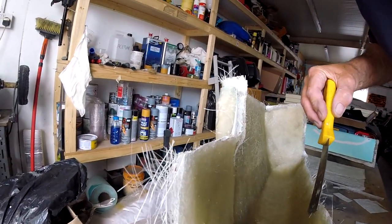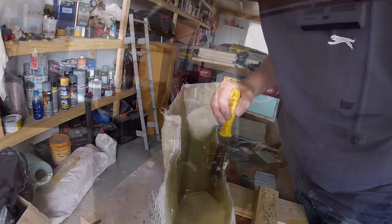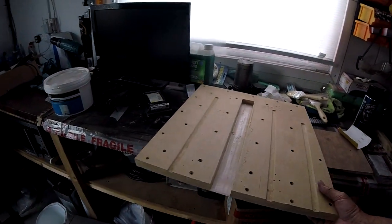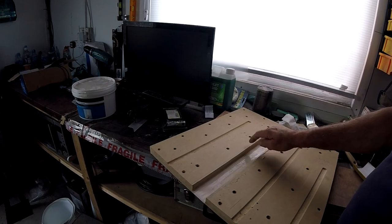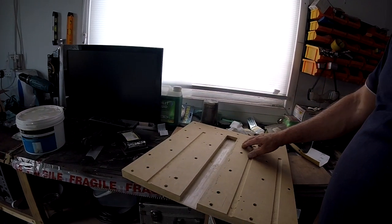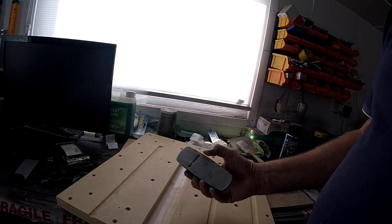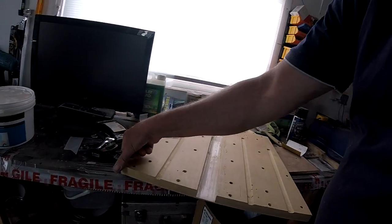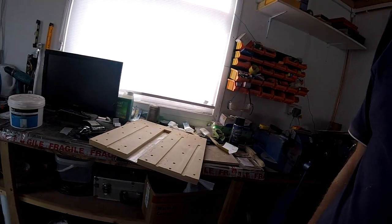Well, I'm on another go with this. It's setting. The side of the van were destroyed, and this is a replica of it. And I got these flutes cut in. Just take a female mould off this, but this needs chamfering back, this edge and this edge need to be chamfered back. There's a rubbing strip goes in there. And I've tried sanding it, it's hopeless. I've ordered a plane, because a normal plane, you've got the edge there where it's casting, whereas a rebate plane, the blade comes right to the edge so I can get in and do the chamfers, and then a piece to add, and then that's going to be another mould. I suppose you call that the plug.